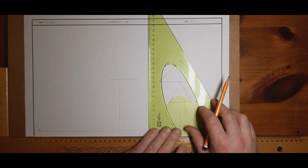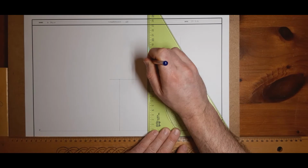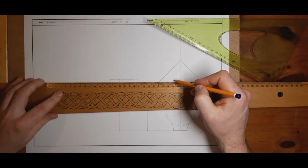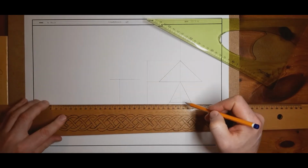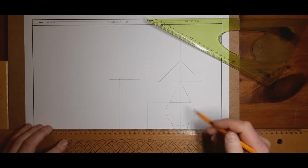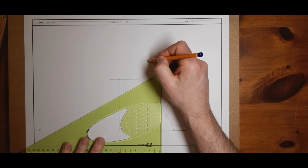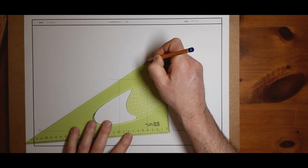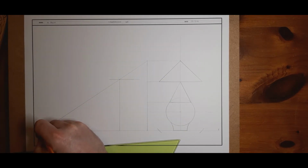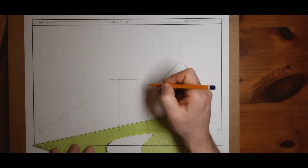Next, we're going to put in what's like a measuring pole here. And what we're going to do again, similar to the last question, we'll run all our heights out to this, our key points. And what we're going to do now is run a line from here through the top there down till you hit the XY line. This will give us a point P. And we'll run the rest of the height lines down to there as well now.